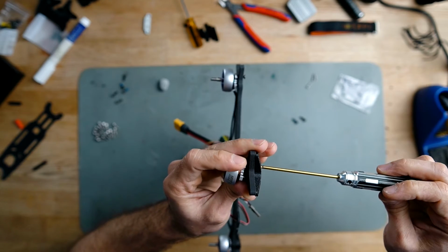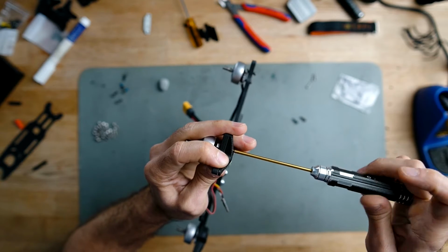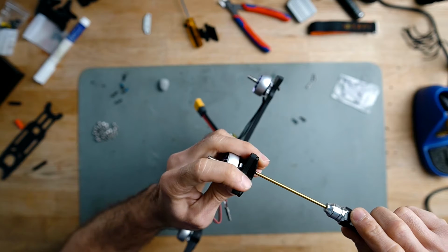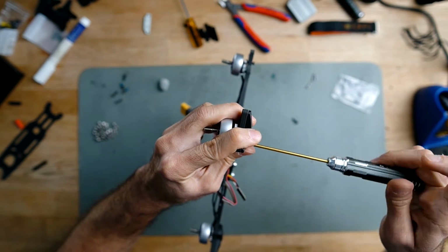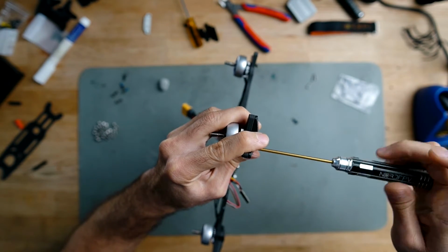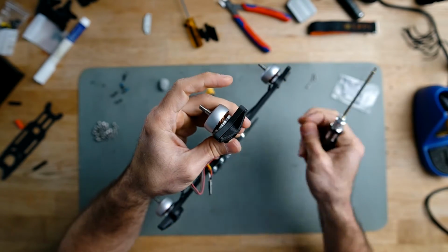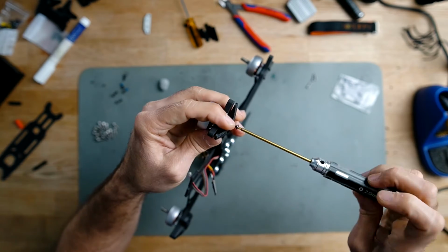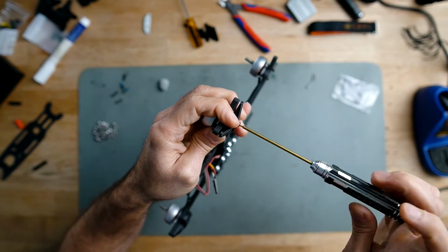The Nord5 frame also has something that we believe is pretty important, and it's these plastic parts. They are not made of TPU because we are trying to avoid vibrations. These parts are made of reinforced nylon, either with glass or with carbon fiber. That makes them very hard, very strong, but at the same time we avoid the vibrations we don't want when flying.